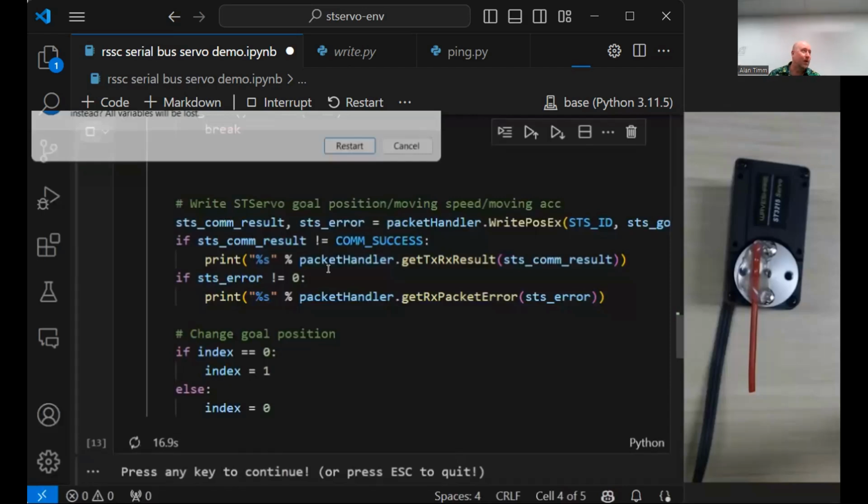So you write a loop that'll just make it go continuous? Just continuous. And what would happen? I'm not sure. Maybe during the break you can try that. But these servos are capable of continuous operation. They use a magnetic encoder, so they're not limited like a traditional potentiometer, and they do accept continuous rotation velocity commands. So you can do a lot of fun stuff with it.